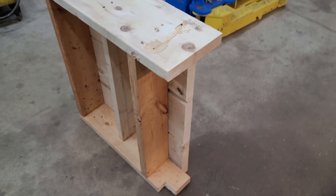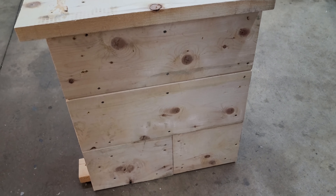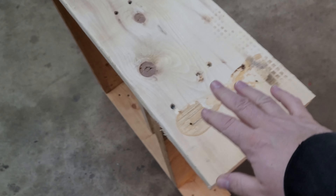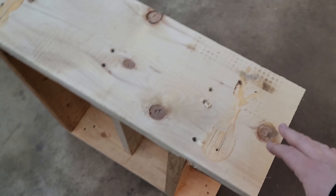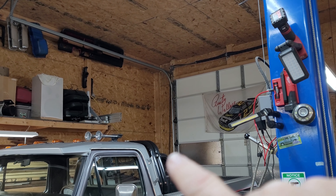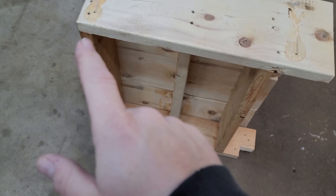This is the platform I built out of scrap wood. That's the top of it. It's made out of two by tens and it's 24 by 26, which is big enough for the base of that air compressor. This piece here is going to be the part that hangs out in the open air. It's notched out so it'll fit in between the brackets of the door where the door goes up and down — right next to the door.